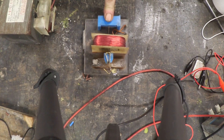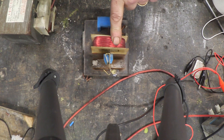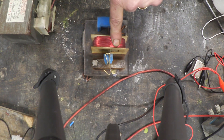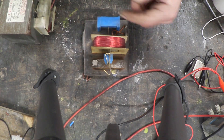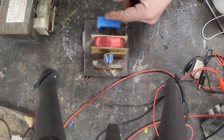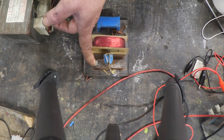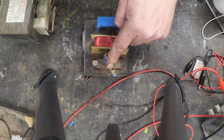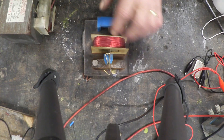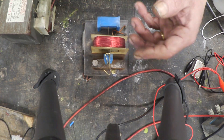The first and most important thing you need is this — it's a vibrator. The construction details are given in the video on how to make a speaker out of a microwave oven transformer. It's a vibrating reed made from a hacksaw blade, with a coil and some magnets. The magnets take the place of a spring — I've used magnets instead. There are a couple of contacts on the end, and as it vibrates it makes and breaks the contact, creating a pulsed DC.